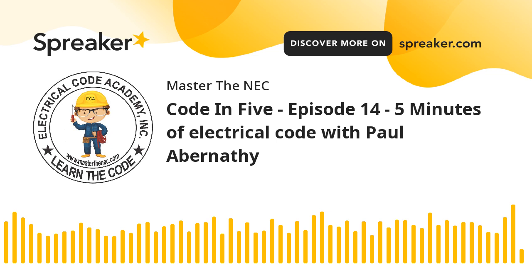So that's done all the time for feeders and branch circuit applications. Here I can do that same thing, even if it was over 250 volts to ground, as long as I didn't encounter any impairment. Now, if I encountered impairments like concentric or eccentric knockouts, then I have to go over to 250.92B and follow those rules and treat it just like I would if it was a service and I encountered those impairments.